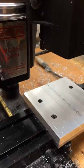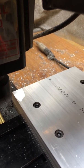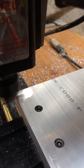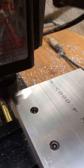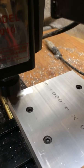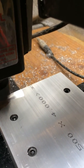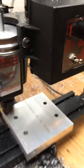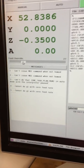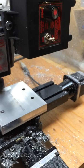You can hear the fly cutter hitting the aluminum and you can start to see this arc develop where it's actually shaving off the top of the aluminum. There's a little bit of shape to it as well because the surface of the aluminum is just not completely uniform — you kind of expect that. We're starting out slow and light. Now I'll come over here and actually speed this up a little bit with the feed control. You can hear it speed up, and now I can see the little flakes flying.